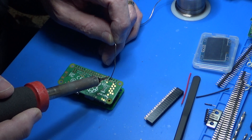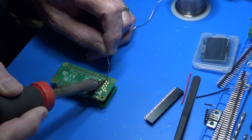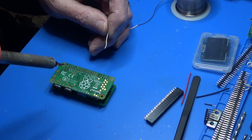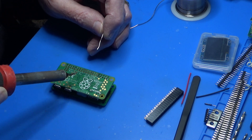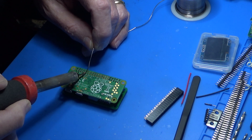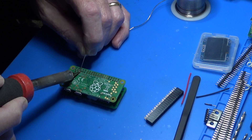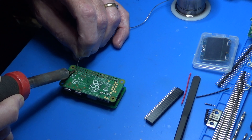That's that side done. You can see the board's just flapping in the breeze here, but that's really not a problem because I just control the iron and the solder. You could use a PCB vice — I've got one, but I don't use it, not for this anyway. You want to have your iron up into the work, not laying down low, because you find that you can hit other things. There's a lot of little test point pads on the board, and we certainly don't want to put any heat on any of those. The trick is good heat and be as fast as you possibly can. Two or three dabs of solder usually does it — just watch it flow right around that gold PCB track and make sure it's floated right around.